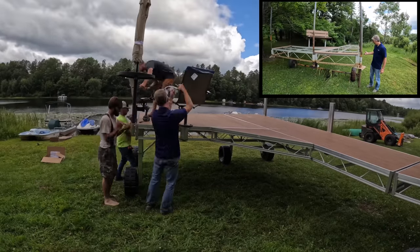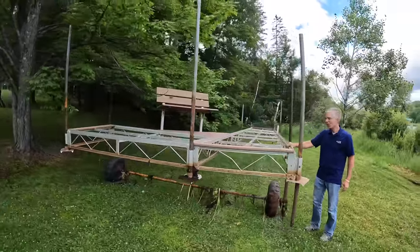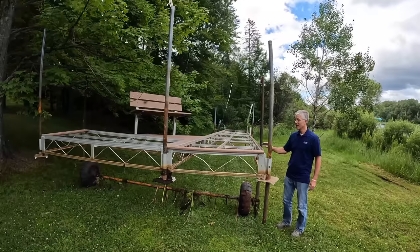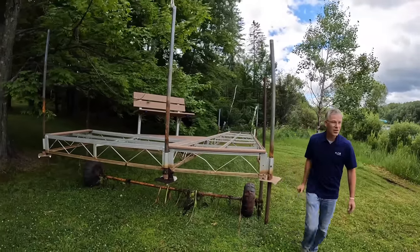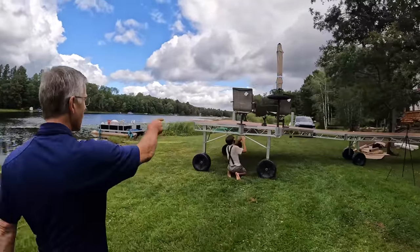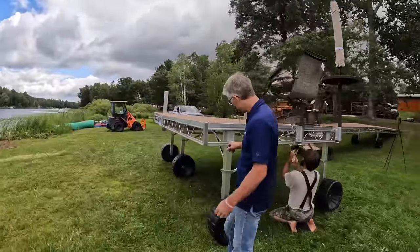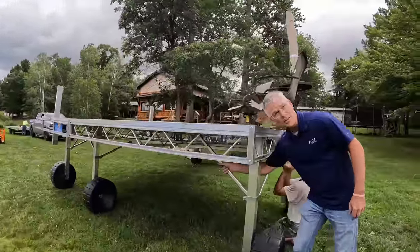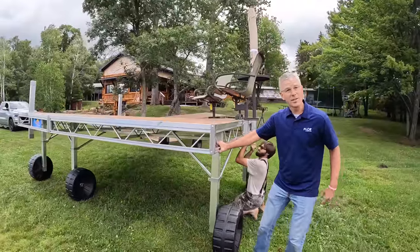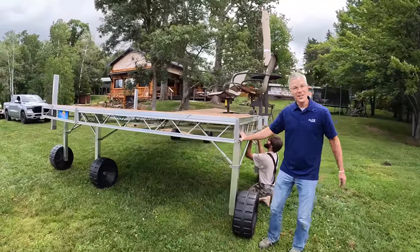Yeah. But the other thing is the stability. Rolling docks are notorious for sway. Look at me. I'm doing this with no effort. And let's walk over there and do that to this one though. You can see how those braces are on every leg. So now we got extra braces on the legs. We've got these braces this way and this way on every leg. And now, I'm giving it an effort here. Before I was doing it with one finger. You're not using one finger anymore.